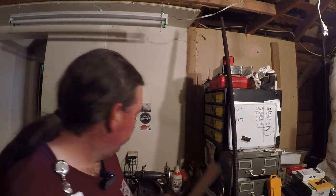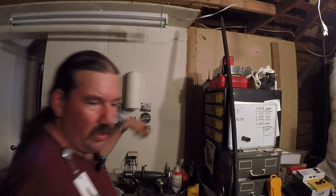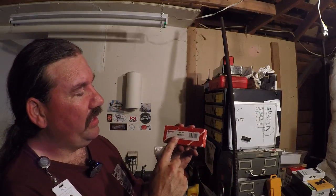And we've got an update on the level — the old Starrett 98 12-inch level. I still got to clean the rust off of this thing yet. I was out hunting around and having a little trouble trying to figure out the part number for the vial. Well, I found it. I managed to get a hold of Starrett, and in case anybody needs to know, it's PT15024 — that's the part number for the 12-inch level at least. I don't know if this vial fits other levels.